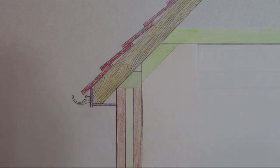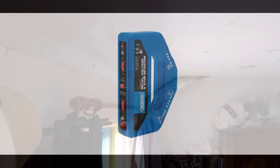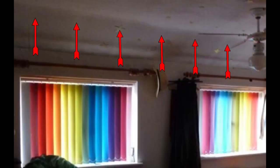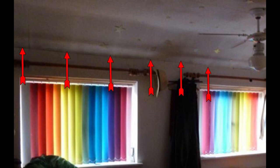Here's the bedroom ceiling again. We need to attach insulation to this surface — there are lots of ways to do this, but I want to make it a permanent fixture, so I'm going to make a box on the ceiling and fit the insulation inside it. There are joists above the plasterboard; if we find their position we can screw through into them. You can see a lighter stripe in the dark bloom on the ceiling — that's where the rafter sits on the other side of the plasterboard, keeping it a little warmer and drier so the bloom doesn't grow as well.